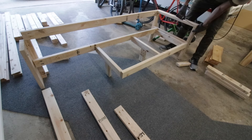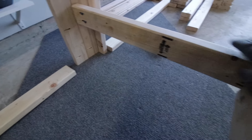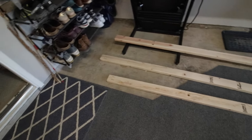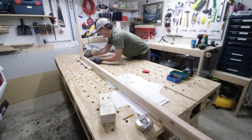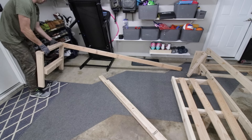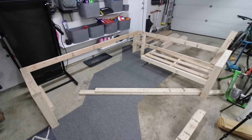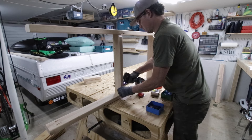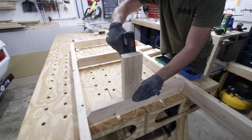After I got the frame attached to the armrest, I'm keeping it open on the back post just to make sure the pieces fit. So before I put that back on, I'm going to work on the long side of the couch. Now I'm back on my workbench with my long side armrest and I'm attaching the back box support. Once I get that attached and secure, I take it over, set it down, and I'm going to secure it to the back post and get that all squared away. Now I'm back on my workbench assembling the long side seat frame — doing the exact same thing I did earlier, dropping those middle seat supports three-quarters of an inch lower and getting it all framed up.